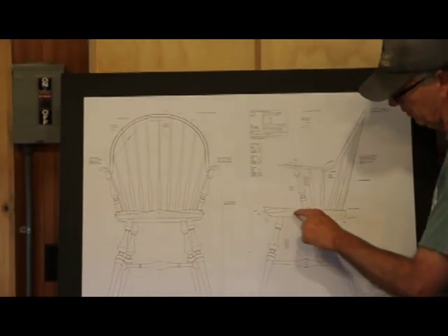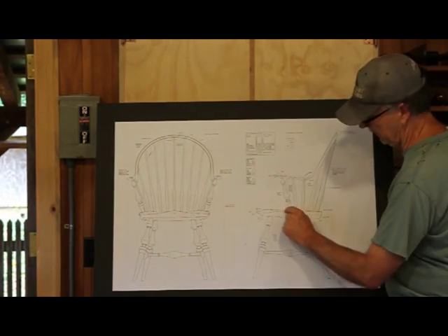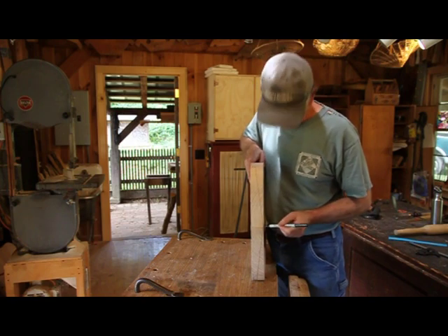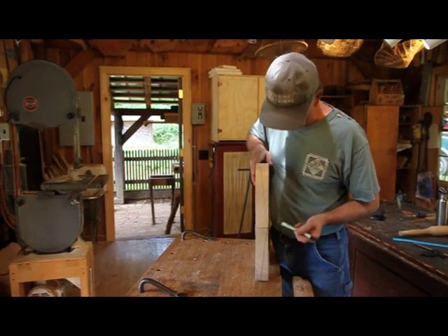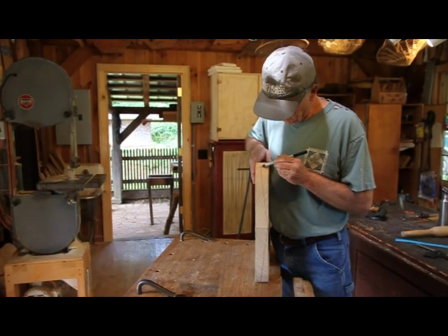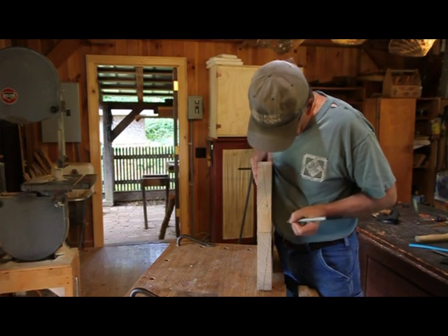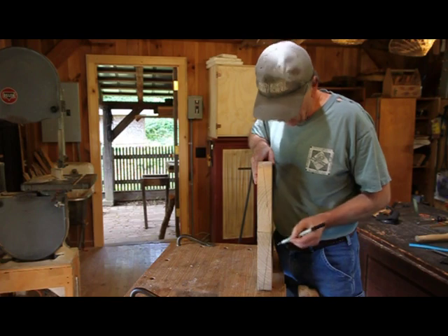I'll do that first, and then I'll go to the side and come up to the front of the gutter, and with a slight sweep, connect the front of the gutter with that three-quarter inch mark. So let's go back to the seat. This is the top of the seat — be sure to do it from the top. I've drawn it from the bottom of the seat before and luckily I've always noticed before I cut. So make sure you're at the top. There's the three-quarter mark from the bottom right there, and I've just connected that with a straight line.